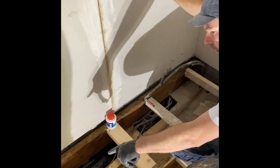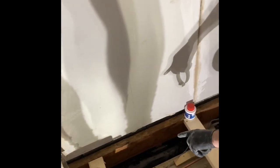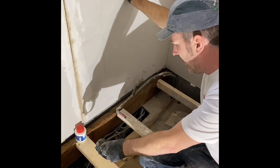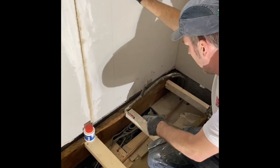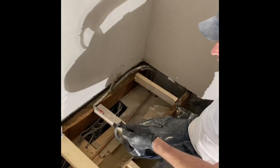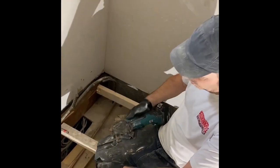So what I've had to do is chamfer that ceiling out a bit to get my new waste pipe in. That there plug, I ain't got a rubber for that, so I'm going to block that off. So I need to get another boss in for the sink. Now ideally I want it there, but you can't get a boss in there. So there's room back there, but I can't get it in. It's got that lug on it, so cut the lug off.